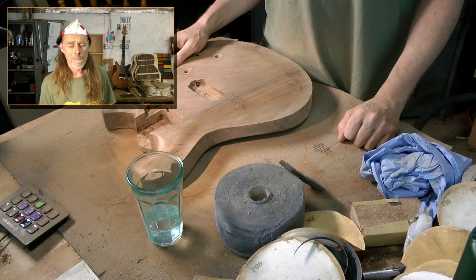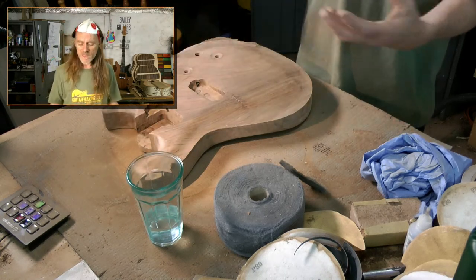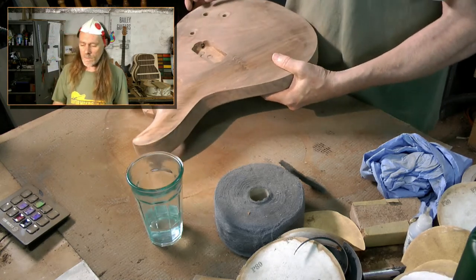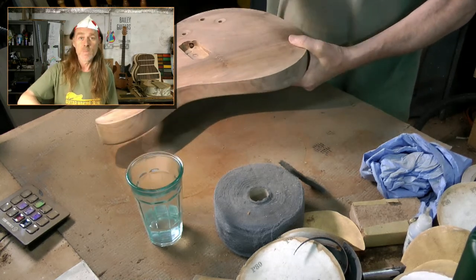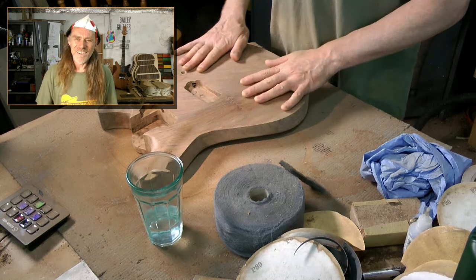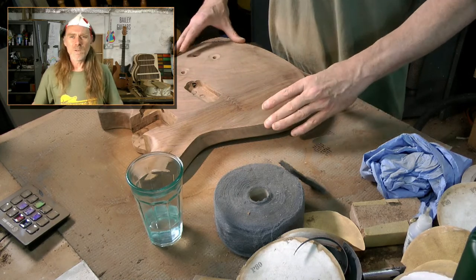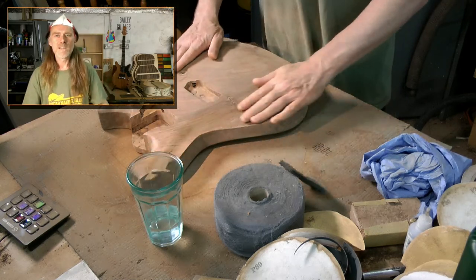And I don't know what it's coated with, but you wipe your surface down and all the dust sticks to your rag. So that's what we use in the finishing shop. And we also use the compressed air just to blow all the dust off it. That also helps a lot. Don't use thinners on it. It will work, but it's just nasty stuff. Your face will go red and you'll start sweating and hyperventilating.